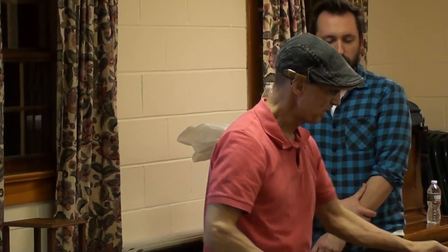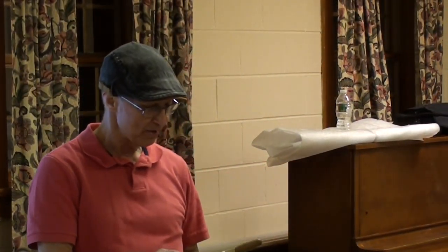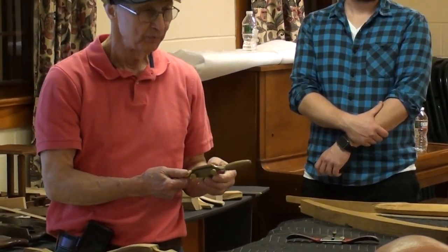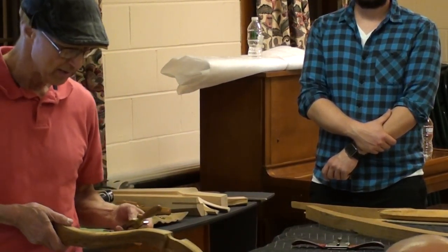If you're taking measurements, you could easily make the curve the wrong way — it could easily go that way instead of this way. And when I say easy, it can be really easy, so you always want to keep testing yourself. A lot of times I'll set one spokeshave heavier and move faster, and then I'll set a spokeshave very fine and just clean it all out.